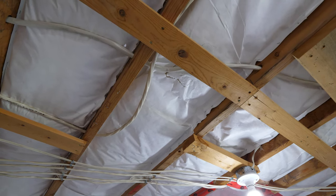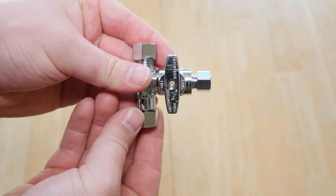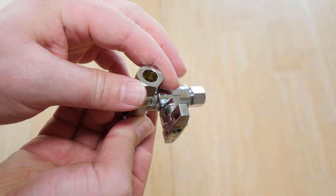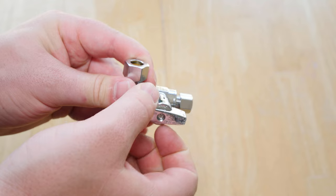I also have in-floor heating on the second floor and I do not want to puncture one of those lines. The three-eighths retrofit tees have a three-eighths compression swivel nut on the bottom, three-eighths compression on top to supply the faucet, and quarter-inch compression on the side for the fridge water supply.